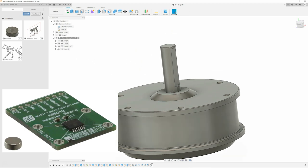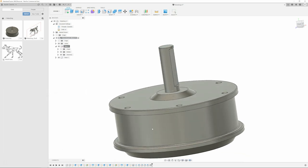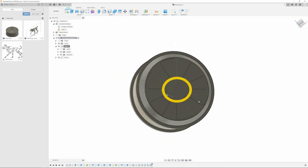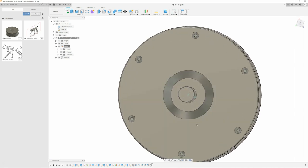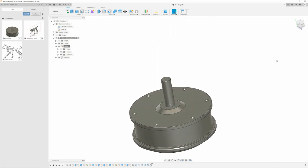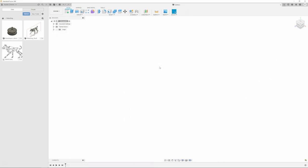We've used this at work. They're pretty interesting - less wear and tear, so that's nice. You're going to have a mounting bracket that goes directly on the shaft - there's a shaft that sticks out on the face with the pattern and it doesn't move. The hub moves around it. There are two pieces to the encoder: one that stays stationary and one that moves. So I was thinking of building an enclosure around the motor, fixing the magnet in a certain spot, and having the encoder turn as the hub turns. Still trying to work it out.